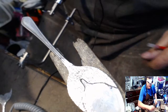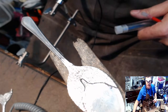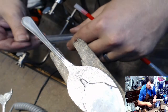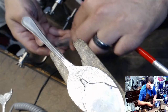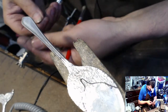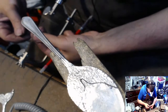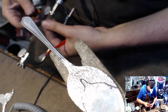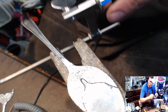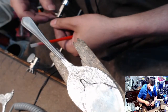If you haven't replaced the blade on these, I think you can see it. Let's see if I can get it to focus past. The teeth need to be going in the down direction. So you grab a blade and you can feel with your finger which way it catches. So I'm going to flip this over because we want the teeth to cut whenever you're pulling down. It goes in between the slats here. So it'll go in there and you're pushing it against the table so it gets nice and taut.